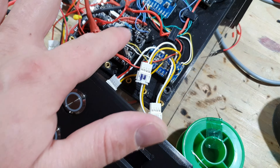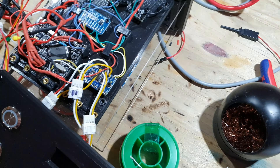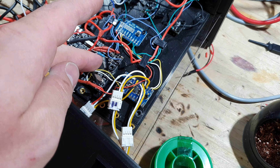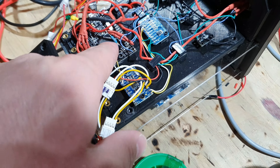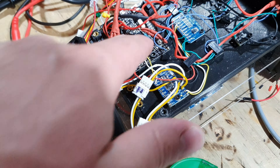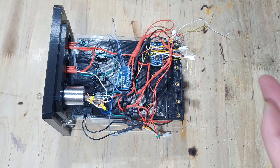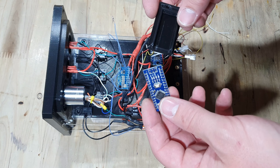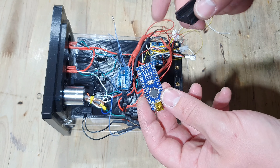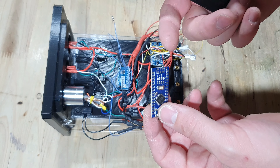What I think is happening is that somehow my voltage is flowing through the Arduino pins to ground. I'm not Marco Reps, so I don't know that much about electronics, but I will use some diodes to fix the problem. Then I think I just fried my Arduino because even connecting the 5-volt USB port, the chip gets so hot I can't keep my finger on it. So I'm thinking about replacing it with an Arduino Nano rather than sacrificing another $30 board before I know what caused this.